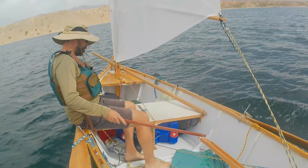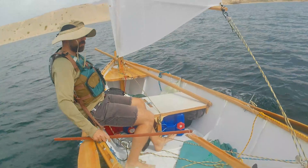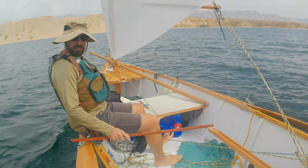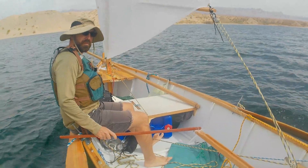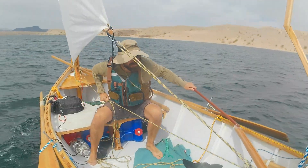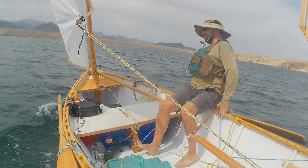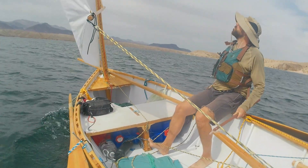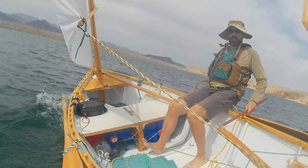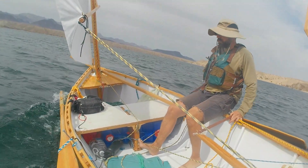Out of the protected cove and into open water, the wind picks up. This is a beautiful day on Lake Mojave — the best conditions I've had this skiff in yet. I can't tell yet if the boat sails better straight up or leaned over a little on its chine, but I'm hiked out on the rail with my toes under the sheet in case I need a strap. When the boat heels from a gust of wind I have to steer off the wind to keep it traveling straight. This brings up another complication in sail balance — the second idea we're going to focus on for designing sails for a little boat.